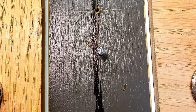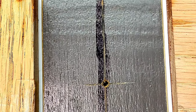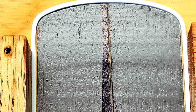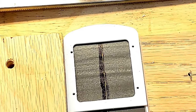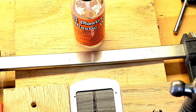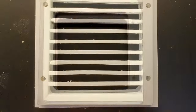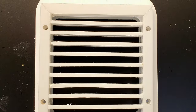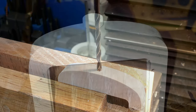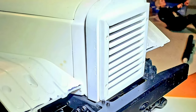Next, I cut a 1/4 inch wide strip of the 80/1000ths polystyrene, heated it in boiling water, and formed it around a 1/4 inch thick wood form, and welded the front and rear radiator faces to it, again using MEK solvent. Here are photos of the fabricated new radiator frame and grille shutters. I finished the new radiator by installing the radiator cap and then MEK welding it to the model's previously shortened radiator frame.